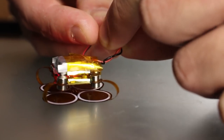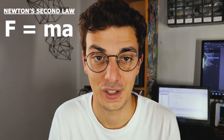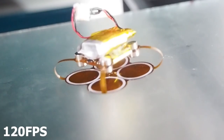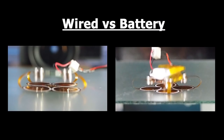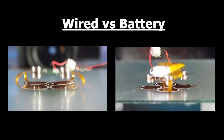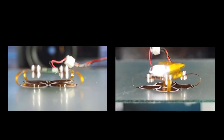It's kind of jumping by a few millimeters. I was pretty sure the robot was going to jump higher by adding an onboard battery because it would technically accelerate more mass upwards — that's Newton's second law of motion. But I was wrong: the jumping height got reduced to almost nothing. Comparing the two tests, the extra mass of the battery reduced the velocity at which the magnets are being pushed. This was some very sad news for my Robofrog.